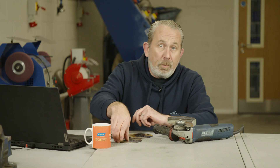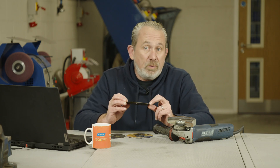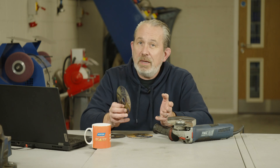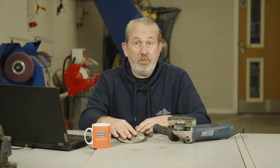We also have a 1.6 millimeter disc for cutting. That will sometimes be a little bit slower due to the fact you're driving a thicker blade through the material, so it'll take a bit longer. You will guarantee a straight cut, but it's just maybe a little bit slower. So my choice from the 1mm, 1.6mm, and 1.3mm is definitely the 1.3 for doing thicker steel.